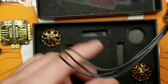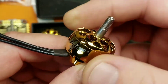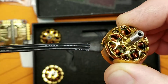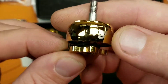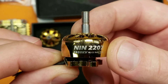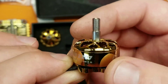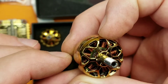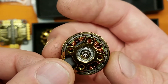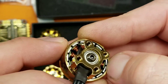These motors are just as beautiful as the ESC. They look a lot like the iFlight Xing motors, and I've heard people say they're made by the same company, though both companies deny that. The look, style, and feel are pretty close. These ones are the 2207 2450KV variant — a little higher KV than I'd like for 6S, but there are ways around that. Really nicely machined motors, though they are a little notchier than the iFlight Xing. It does have a lip on the underside of the bell to keep the magnets from slipping.